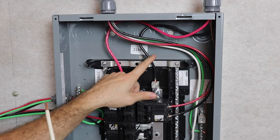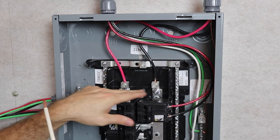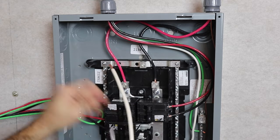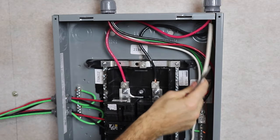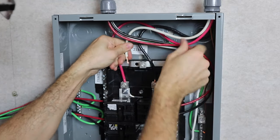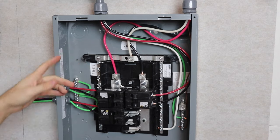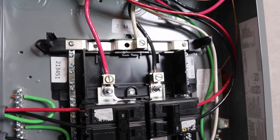Now I'm going to run our 6-3 wire — our big wire — back to our main box. We've got our line one and line two taped the same as everything else in the entire system. I've got the neutral and my ground here. I'm going to sneak it up through and keep all our big power wires in the back, make it all nice and neat and organized. You can see each wire coming in from each component of the system — it's all organized and in order.